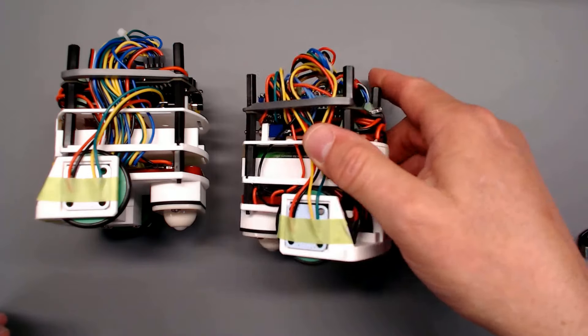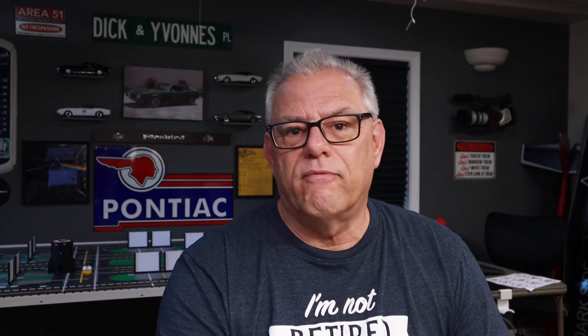The technique is important: put the connector pin in, start closing the pliers, pull down until it catches on the step in the jaw, give it one more click to hold it in place, then thread the wire into the hole — which with bad eyes is not easy. Really good lighting helps immensely. I think I've got a good tool that will make life a lot easier when wiring up the remaining 14 robots for the Zoom Town experiment. Thanks for watching — see you in the next video.